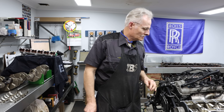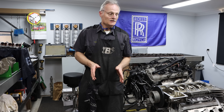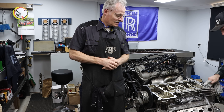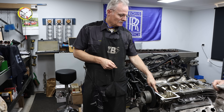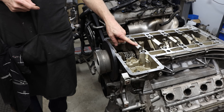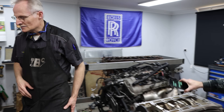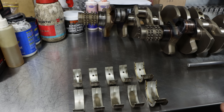Just to add a small detail — the S65 four-litre V8 was released after the S85 five-litre V10, and quite a few components are common to both engines, such as conrods and pistons. But what the designers changed — and I think this is something to do with the problem — is the timing chain arrangement at the front of the crankshaft. It's a lot different to the S85. We don't see this number one main bearing problem on S85s — S85 issues are pretty much the same with regard to rod bearings, but this main bearing failure doesn't show up on the S85.